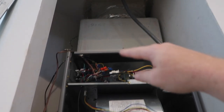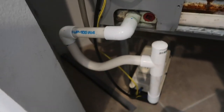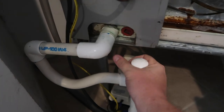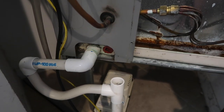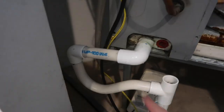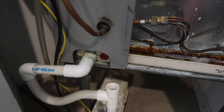On an unrelated note, this is interesting — they added a pump here. You can see they are pumping it up into this drain because when they installed this new unit, it dropped down further, so they had to pump it up into the drain. But then when they did the trap and vent, they set this up as a clean-out, which should actually be a vent higher than the drain level. The problem is that would be in front of the filter, so the clean-out should be here for the trap, and there needs to be a vent that's taller — so this needs to be redone.